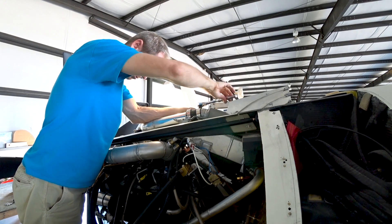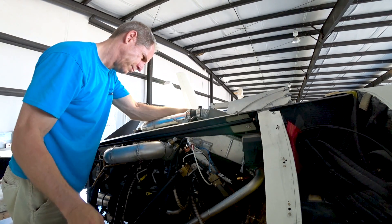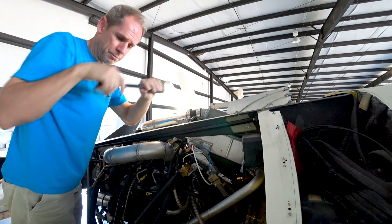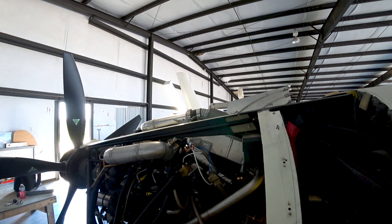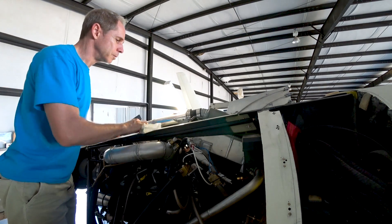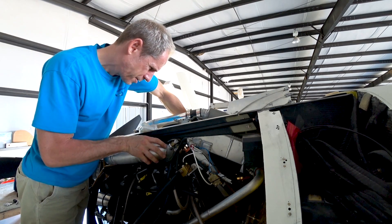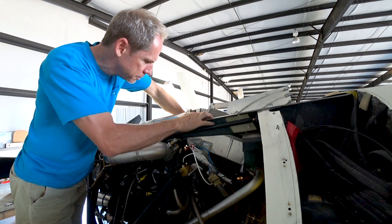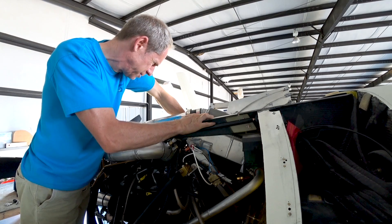Welcome back. Starting out the week, the first thing I wanted to do was check this oil filter and just make sure it was seated correctly. Some people had commented on the previous video that I may not have got the little tab on the bottom of the filter aligned with the little hole in the casing it's supposed to sit into. My take was it was probably going to be self-aligning anyway, because you wouldn't be able to tighten the cap all the way down unless that tab was sitting in the hole — but anyway, it's worthwhile checking and doing it the right way.